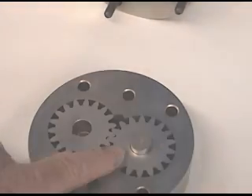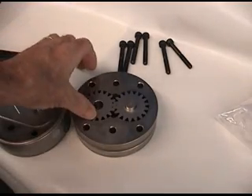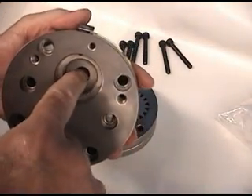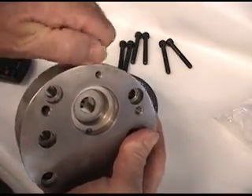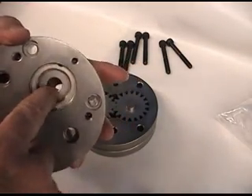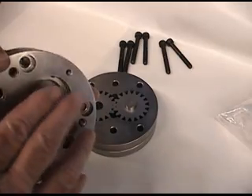These are very simple devices with only two moving parts. The pump has a drive shaft with a series of seals and packings. That drive shaft drives the drive gear, which in turn drives the driven gear. One of the benefits of using the Ashby Cross gear pumps — especially with urethane — is a wet cup built into these pumps where you can add iso oil that floods the seal area. This maintains the integrity of the seals, because isocyanate will crystallize in the presence of moisture and air. The iso oil also prevents the material from being contaminated.